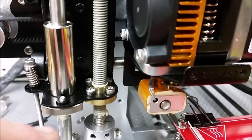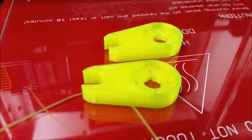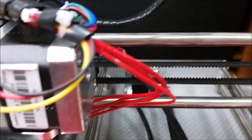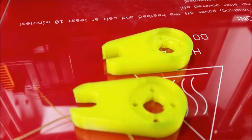I did use lithium grease on both the rods. The threaded rods had a real bad squeaking noise, but by adding lithium grease it got rid of the squeaking. And I figured that running the lithium grease on the straight rods will help keep the bearings from wearing out sooner.